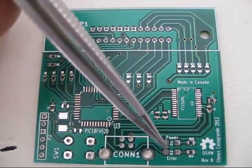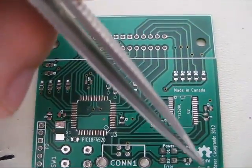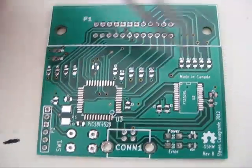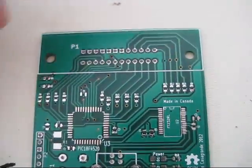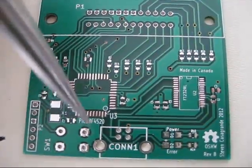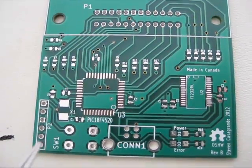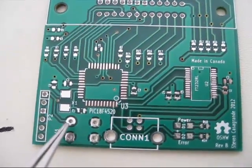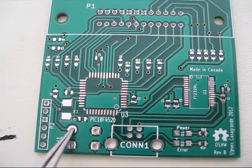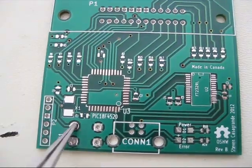Some of the early differences — here in the corner I added some LEDs with current-limiting resistors, the open source hardware logo, my name, and 'Made in Canada,' because the boards are made in Canada and assembled in Canada by yours truly. If I ever go to automated assembly, it'll also be assembled in Canada. Here's a reset switch, and this is one of the mistakes I made in the design — but thankfully it's not a problem because I can easily correct for it during assembly. I forgot that one pin on these push button switches is also directly connected to another pin.